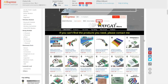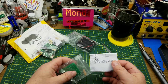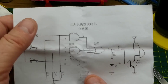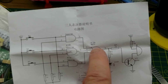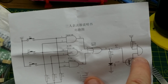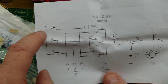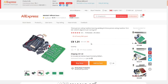This seller has lots of kits; I may have to come back for more simple ones. The other kit has a battery holder in it. The schematic shows three buttons, a 74HC08 — three sections of it — a 4075, and a little transistor driving a buzzer. Yes, there's a little buzzer in there. Three push buttons — is this one of those game show timer things?